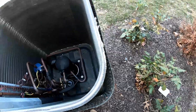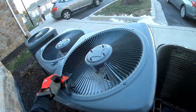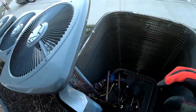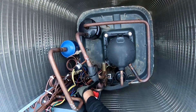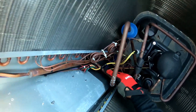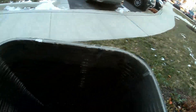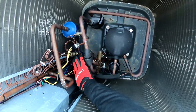We're going to fix that — cut the wire, strip it, wire-nut it, and tape it back up. I also saw some wires touching off of my low-limit switch and went ahead and taped that up too, just to prevent anything else. While you've got the top off, inspect all of your wires and make sure everything else is looking good since you're already in there.